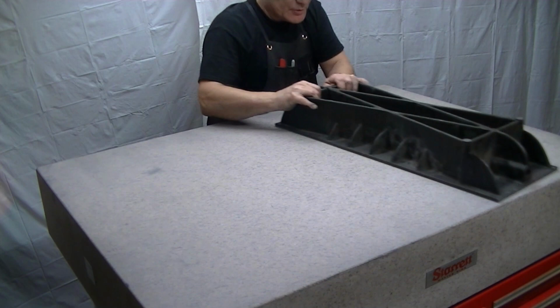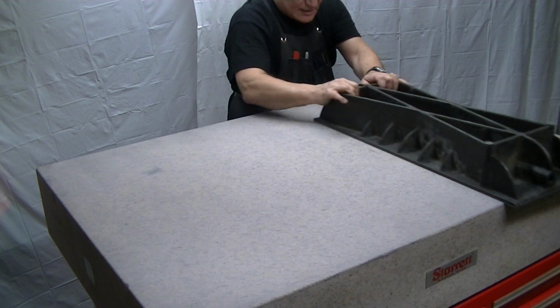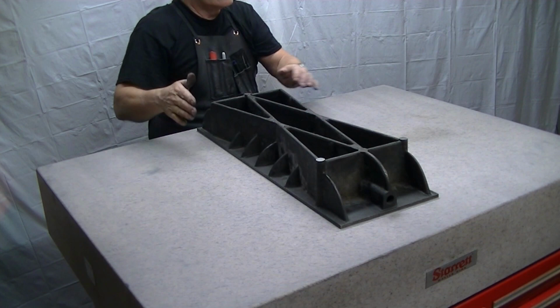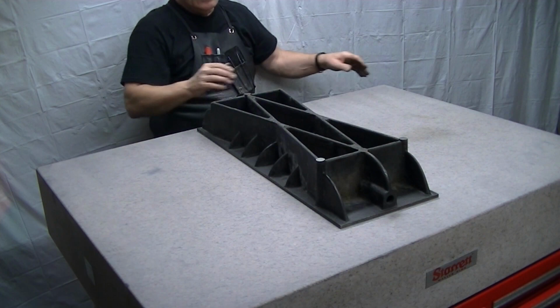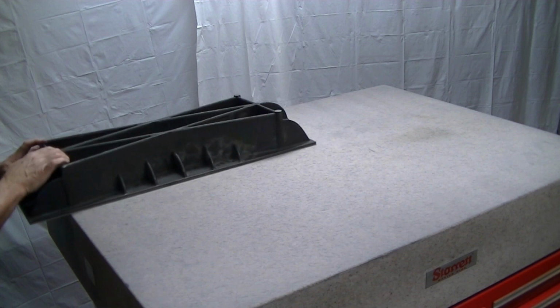I'm just pointing that out as a technique, just like scraping, where you progressively mark out your path where each successive path is taking more and more distance, you know, the first cut, second cut, third cut, fourth cut, fifth cut, or vice versa, some controlled method of stepping. Now I'm going to go this direction, using the long length of the lap to counteract what I'm doing here.